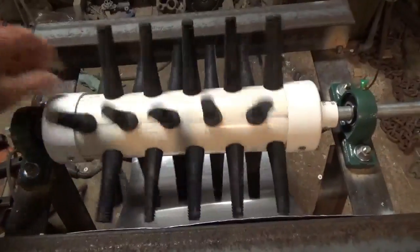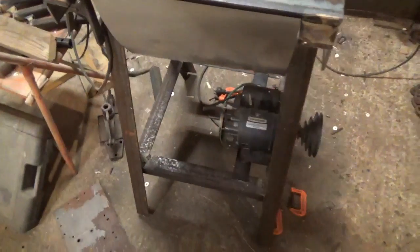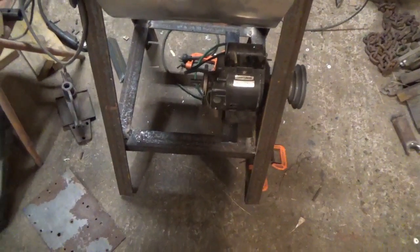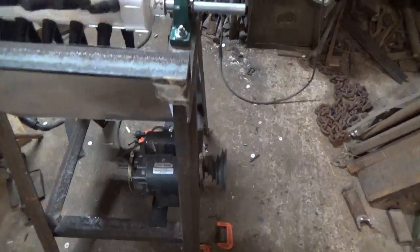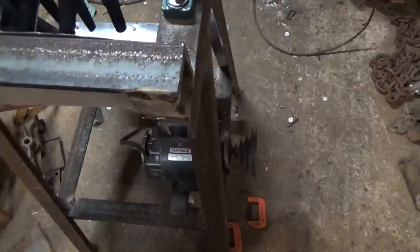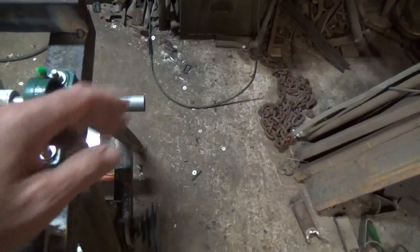See, there's not a lot of torque on this. I don't really like the way this motor mount is, but that's what I have to work with — it sticks out on the side. I've made this shaft longer so that if I decided to use one of the other grooves on this pulley, it can move out with the top pulley.